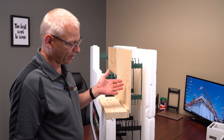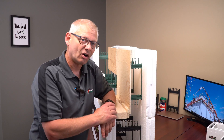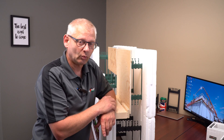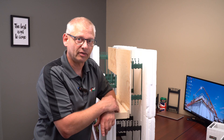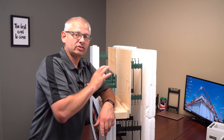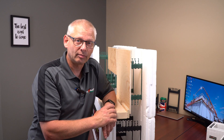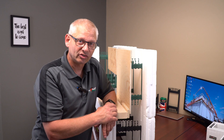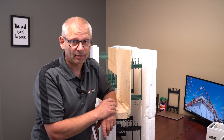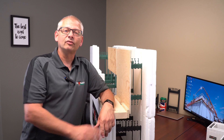For a 16-inch floor, that would be great. Why would you want to do this on a wood floor when you could just put a wood floor out? On the jobs we have been doing this on, their backfill is coming up higher than the wood floor, in which case they have to do something — and this gives them that solution. Some guys just want this insulation on the outside and it eliminates all that issue on the inside. That's why we have a curb block. Let's take a look at the video I have just showing the end result of a curb block, and you can decide if a curb block is good on your job site. It's not going to be for every job, but for the jobs that need it, it's just a lifesaver.